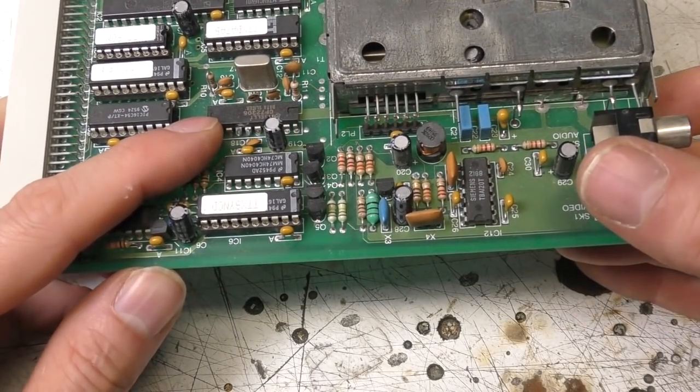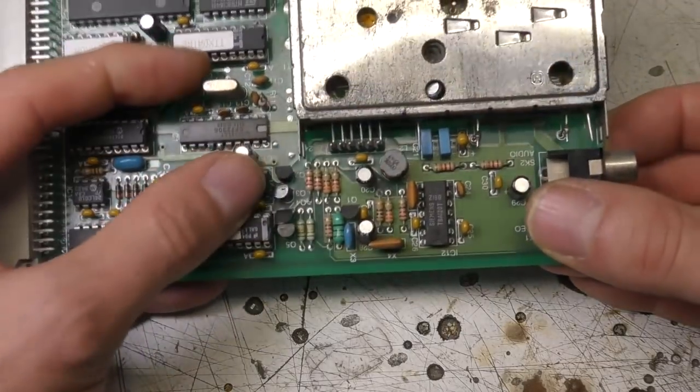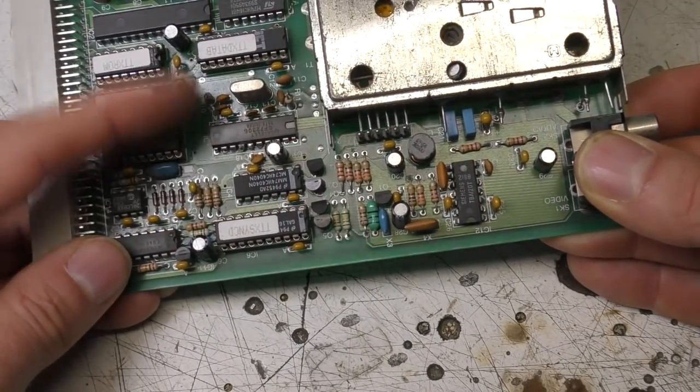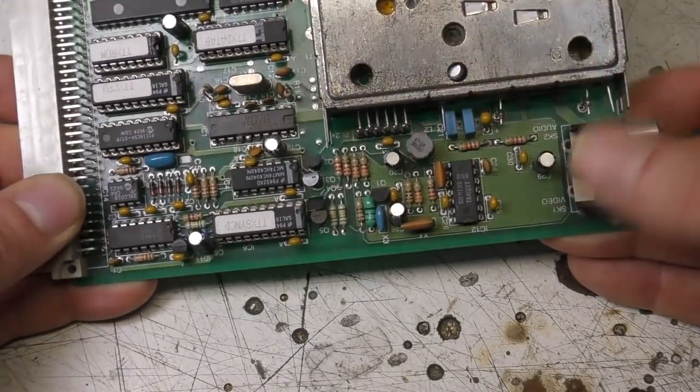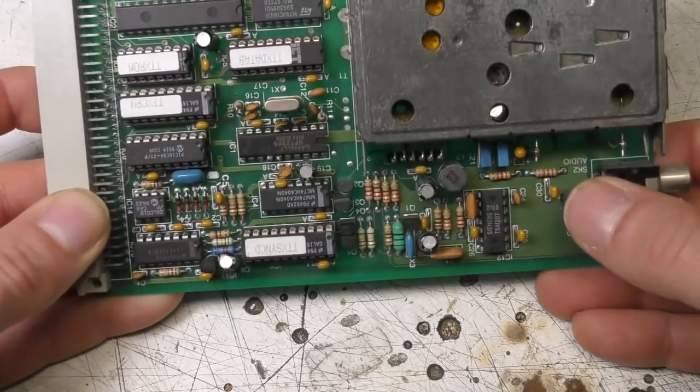It's a CF72305, and this literally just does the analog data slicing part. So it takes a video signal and produces a clock and data out and sync signals. The companion chip to this will then decode and produce the display stuff.